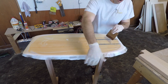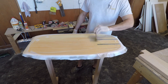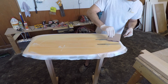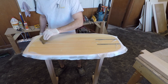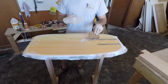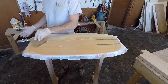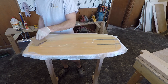I just waterfall it over the edge — actually I don't like to do that because it wastes a bunch of epoxy. I'm just going to get it right up to the edge pretty close, then carefully go around and do the sides. Don't feel like you're in a rush. With this epoxy I get about 30 minutes that I can actually work it, so I'm in absolutely no rush to get this done.